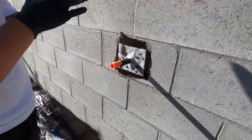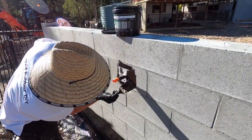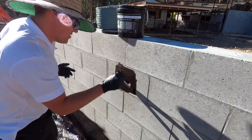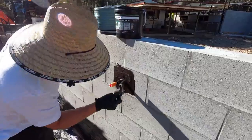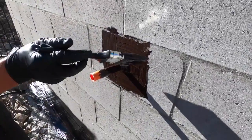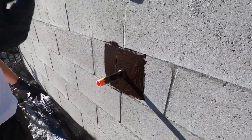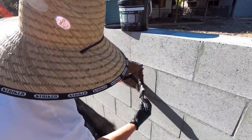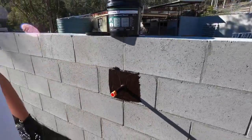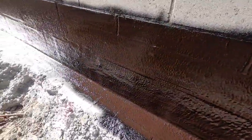This is all stage one — the wall floor join, or what we call detailing — followed by two to three coats over the next day. We're building up a 1.5 to 2mm membrane. That's got a double layer of geo: 150mm geo in the wall floor join. Always do the wall floor join.